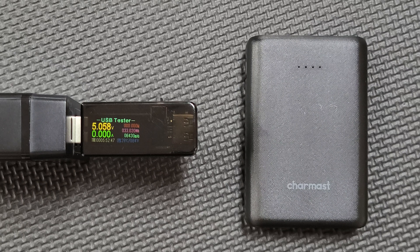The cells inside almost every power bank have a nominal voltage of 3.7 volts, and manufacturers typically rate their specs based on those internal cells. So we're going to adjust the meter reading by multiplying by 5 and dividing by 3.7 to give us a sense of what may be inside this power bank. In this case, that results in an adjusted capacity of 8,689 mAh.